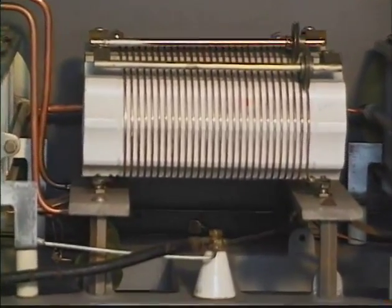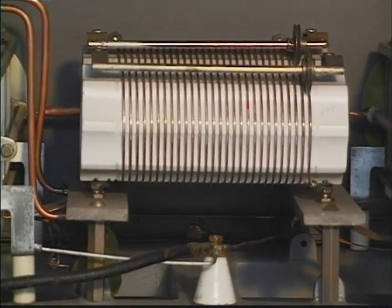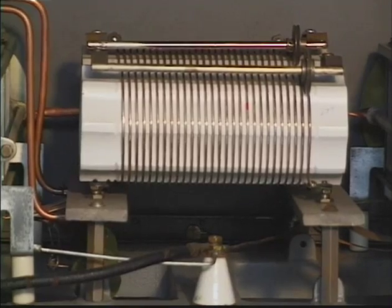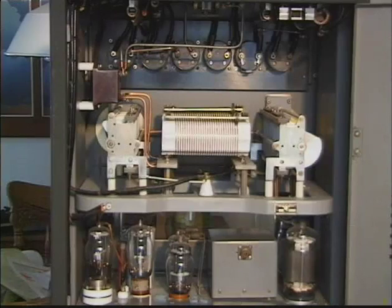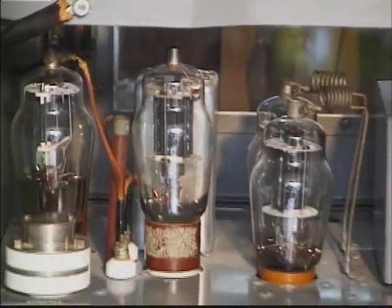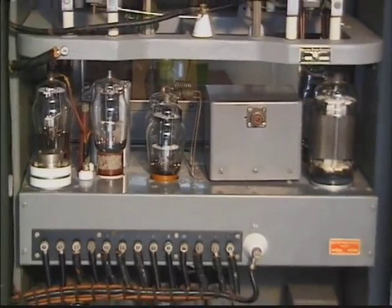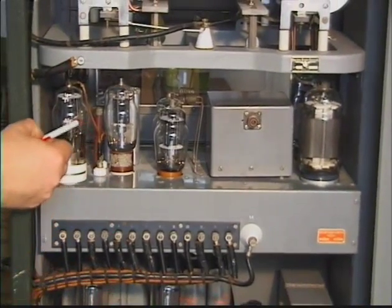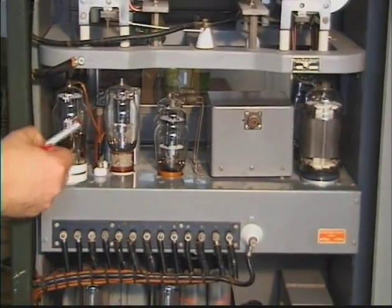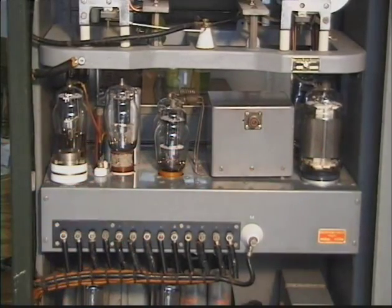This assembly also appeared in the commercial 600A2, which was introduced a month after the 30J. The standard output was balanced, but a phasing coil option could be added to convert to unbalanced. By about 1938 or 39, the fences had been mended with RCA, and the 30J RF deck underwent a minor redesign to use more mainstream tubes, including the 802 in the oscillator assembly and a pair of 813s in the final. This model was designated the 30J18.